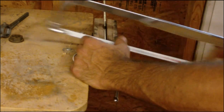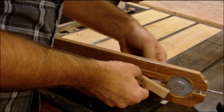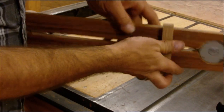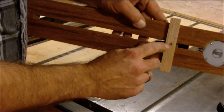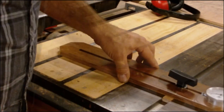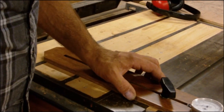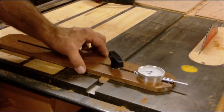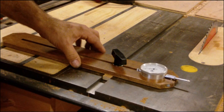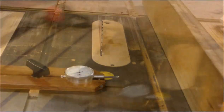Remembering that I want it shorter, I'll come right past the tape by a 16th for a thread or so — that's where I'll cut. I may have to run this to a grinder to get it started. When it's tightened all the way down, I want it to still not be poking out the bottom — looks like about an eighth of an inch, so that'll work well. As far as the fit goes, that's actually a good fit — hard to achieve. I don't think I'll sand it because that's a good fit, and it's ready for use.